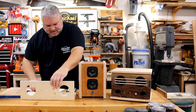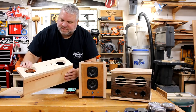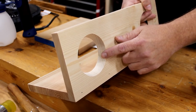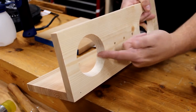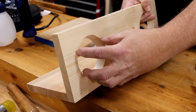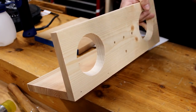This was kind of a prototype I put together. One thing I did differently here is I tilted the table on my scroll saw and cut the speaker holes at an angle that would kind of line up with the speaker cones, thinking that the sound would project a wider range. That's just another idea you could use if you're making your own speaker.